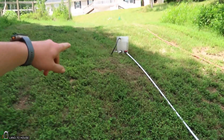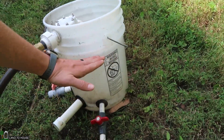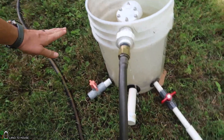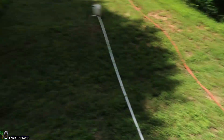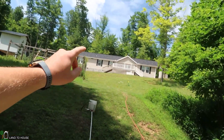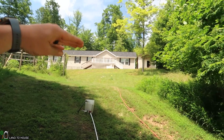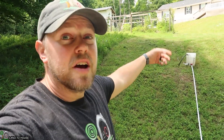The water in the bucket here has a float valve that will keep it pretty consistent at that level. I'll find a point on the hill where the laser hits that point, come over here, hold up a tape measure and get the exact head pressure as that laser level shoots out. I've got some markers that we will use to go up the hill, and I'll use the same setup with the tape measure and level to find maybe 20 foot, 25 and 30 foot, and we'll see how well the pump does off of this head pressure.